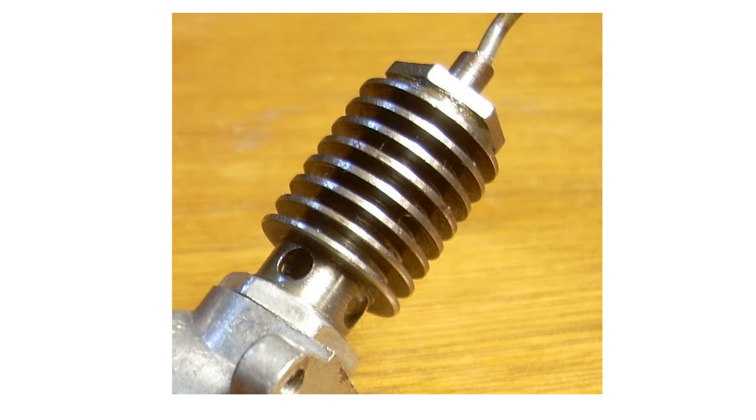You might wonder why CO2 motors have fins on their cylinders. In contrast to internal combustion engines, which are trying to dissipate heat from their hot cylinders during operation, the CO2 motors are the opposite, trying to absorb heat through the fins to warm the motor, which is being rapidly cooled by the expanding CO2 gas. And in fact, under humid conditions, you can see frost forming on all parts of the power system.